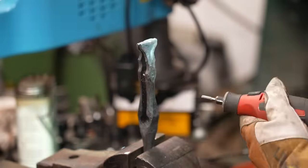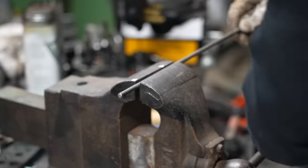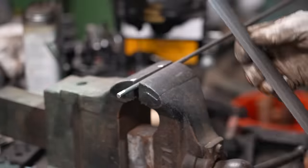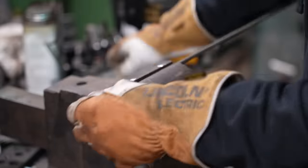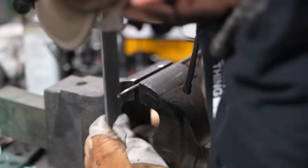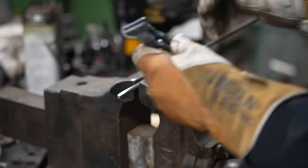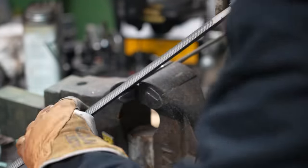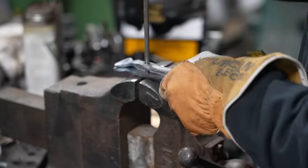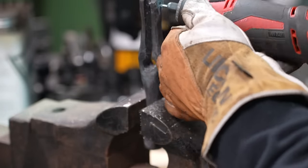To make the screw seat nicely I want to square up the hole in one side of the vise using a little carbide burr. Then I take a piece of quarter-inch bar stock, file down the end to make a little stud I can hammer in, going for a slight taper and a square profile so it can't spin even after I peen it in — this thing's going to be in there for good. A couple strokes with the file and adjusting as I go gets it to a nice friction fit even before heating and peening.